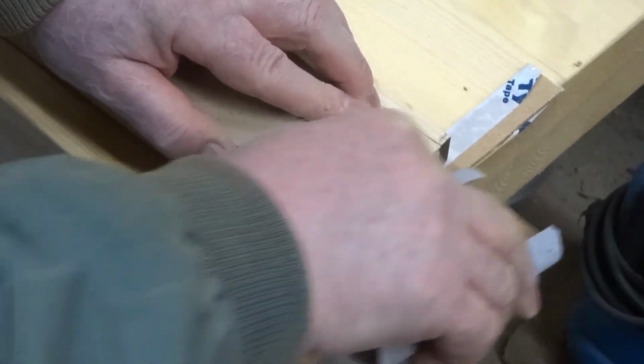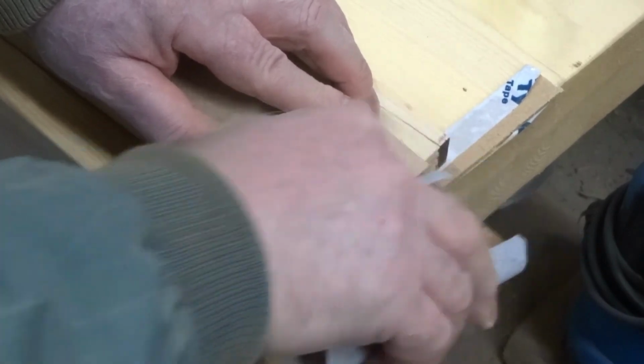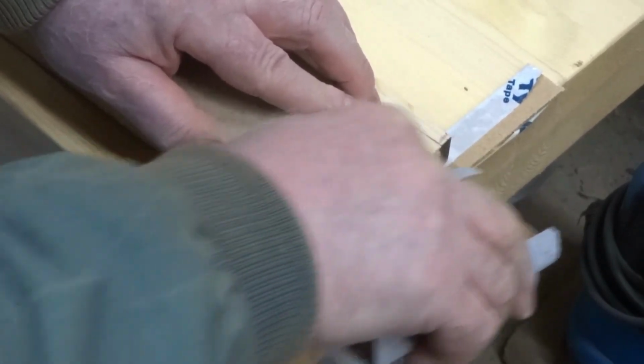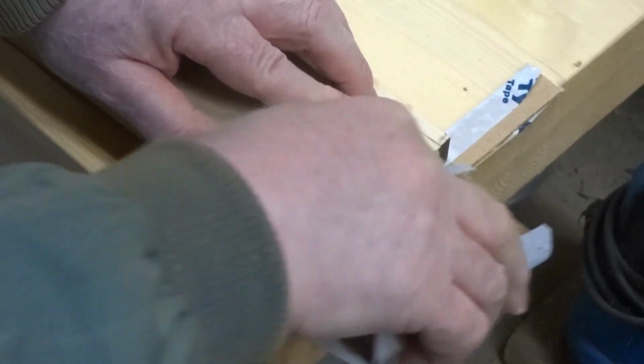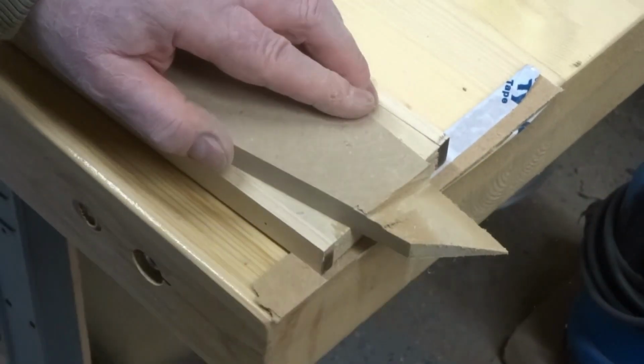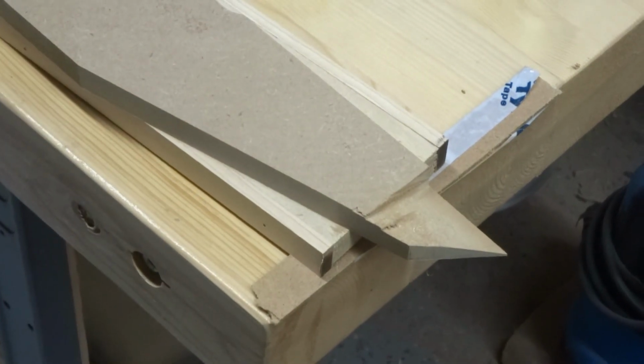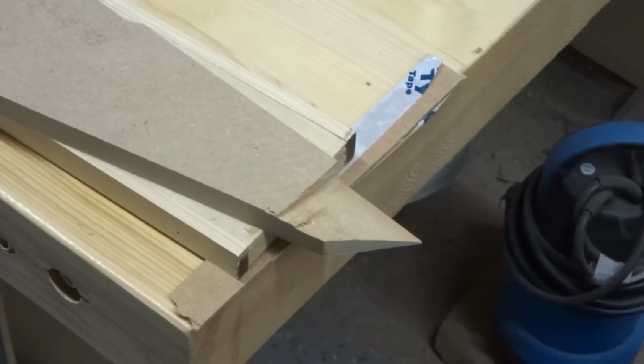Trying to rub down MDF with sandpaper and files takes a long time and doesn't produce a very good finish. So the Bondo on the MDF produced a very, very fine surface, and as you'll see in later segments, I used it in a number of places to improve the surface finish and to get a better representation.